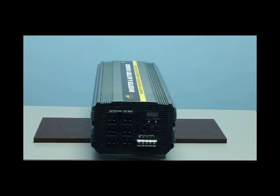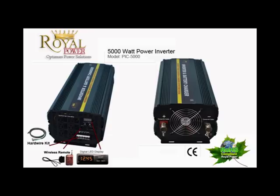This unit features a built-in 50 amp charger and automatic transfer switch. Which means if you have the hardwire connection kit installed, you will be using your utility power to charge your batteries and to power your devices when utility power is available. The intelligent charger will stop charging once your batteries are fully charged. If you have a power loss, the unit will auto detect a power failure and automatically switch over to your battery power. When you regain power, it will switch back to your utility power. This makes for the perfect setup if you have a sump pump, fridge, freezer or any other items you want to remain powered on in case of an emergency power outage.